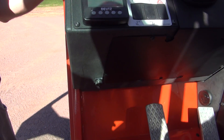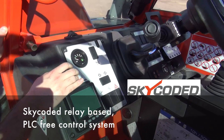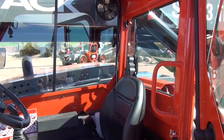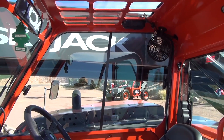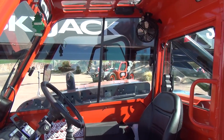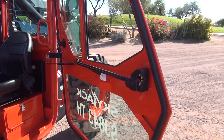All the steel panels on this plastic dash are removable, giving access to our relay-based and hard-wired control system. Just like our booms and our scissors, everything on this machine is controlled with relays and point-to-point wiring — the only computer on this machine is the engine control unit. Underneath the dash, we have a large removable steel panel that gives full access to the steering orbital and allows it to be removed as a single unit. On this closed cab machine, we have a sliding side window, a split top window, and a glass lower panel allowing visibility out to the side to ensure you won't run into anything alongside the machine.